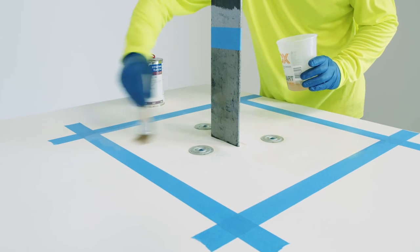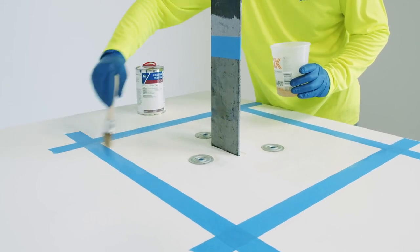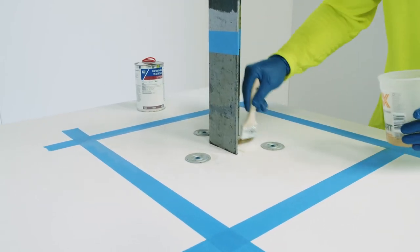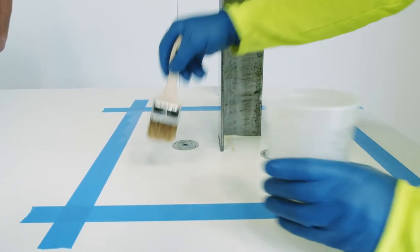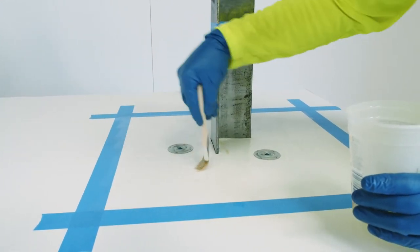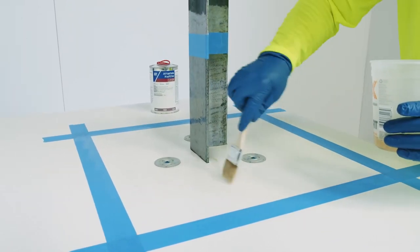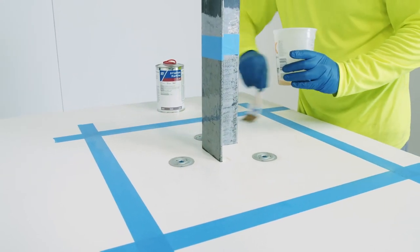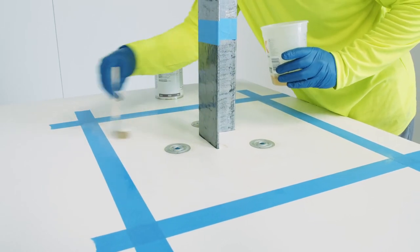We did the metal primer first — is that best practice? I would advise it. The cure time on that primer — you want to make sure it's all the way set up before you start doing anything else. Also, since the membrane primer flash-off is so fast, just from a productivity standpoint you'd want to start with the metal primer. We did the sanding on the membrane before any primers went on to make sure we had that abraded membrane where the metal primer was going to overlap onto the membrane, and also to avoid creating debris or damaging the top surface of the metal primer by abrading after it was done.